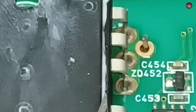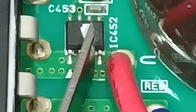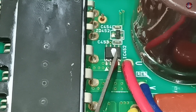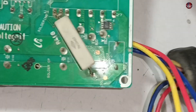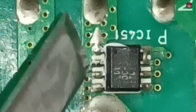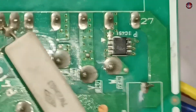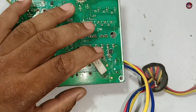You can see these are the negative pins of the IPM, and with it the W pin. The W print is cut off on the board — being cut off, the continuity of the W pin is completed through this IC. This IC senses the current in this motherboard and tells the microcontroller how many amperes are passing through the circuit. The number of this IC is ACS712T. The company has installed another sensing IC in this motherboard — the cut is present here on the U print of the IPM. You can see the print is divided in half and the sensing IC is attached between them. Both these ICs are used for sensing the current, through which the microcontroller senses the current and completes all the circuit board functions. If any of these ICs will not work, it will show the current sensing error.